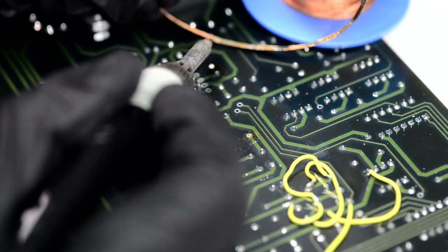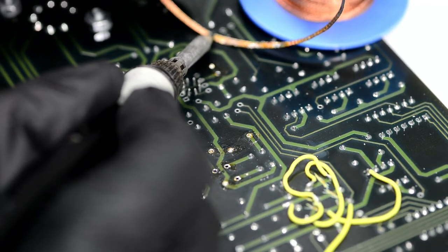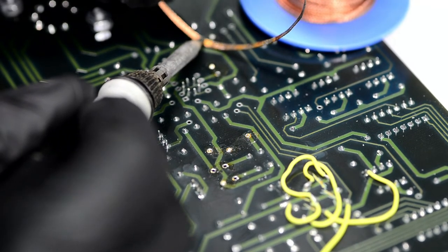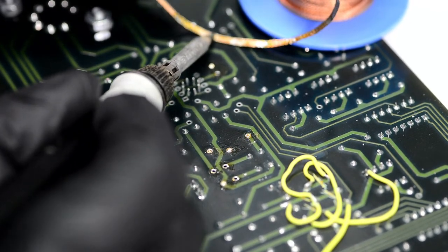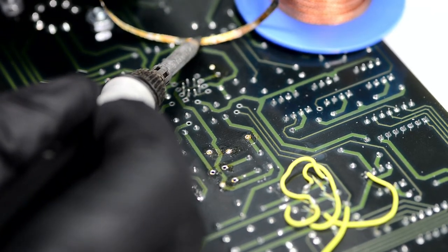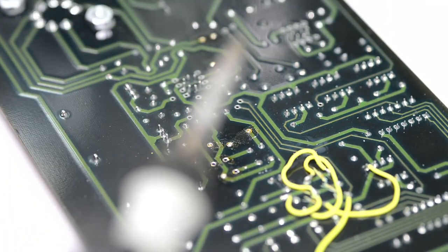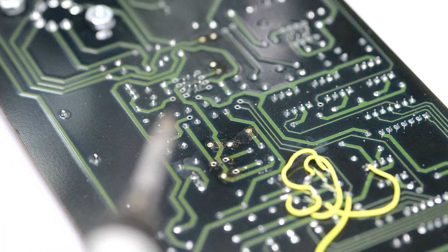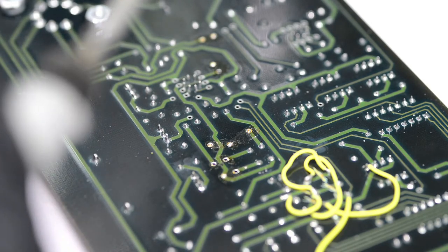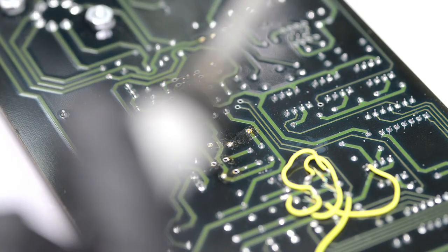Also, another interesting thing is there is no fan in the bridge. The bridge is taking only about 25 watts of electrical power, and its big enclosure helps with thermals pretty well. So it's not like you have huge high power stuff inside, but still those op amps, they get very toasty, the big PA07 jobbies.